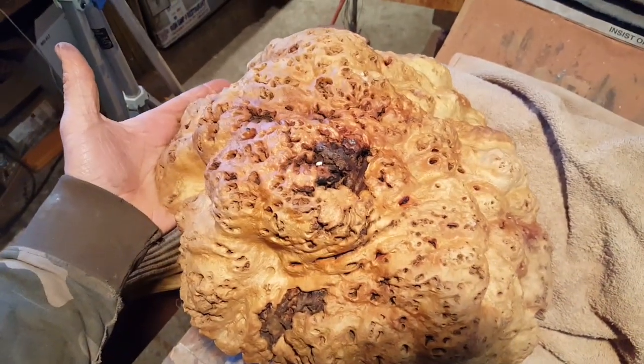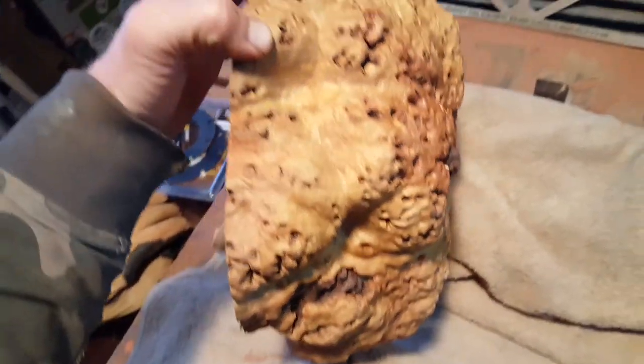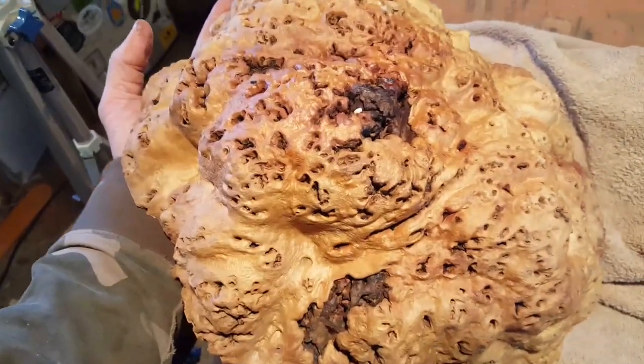So this is Australian Red River gum burl, and it's pretty hard wood. It's got a decent hardness to it. One thing that makes it real tricky though are all these voids. There's encased bark, a lot of odd growths and stuff in there, and more of it reveals it's totally thoroughly porous. So sharp tools are essential.